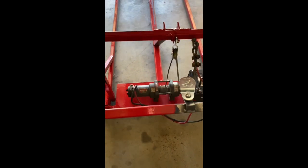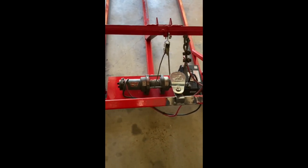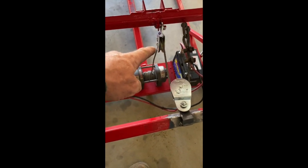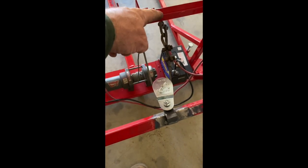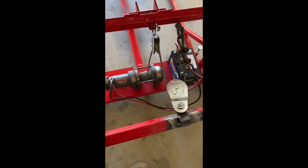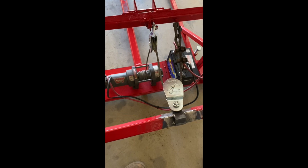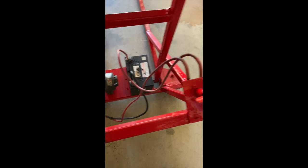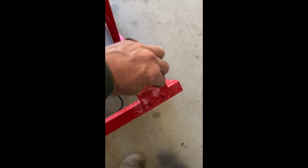There's the winch system. I've actually doubled this winch up — it comes from the winch itself up to the first block, goes around the second block, and then back to the winch itself, so effectively I've doubled the power. A two and a half thousand pound winch would pick this up easily anyway; I did that to gear it down so it doesn't raise or lower too quickly. I've run the cabling through an isolator purely for safety, so I can isolate it completely — useful if there are kids around.